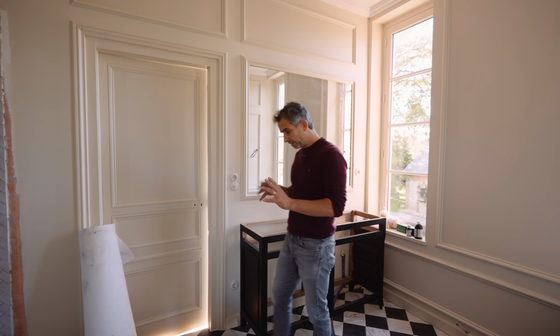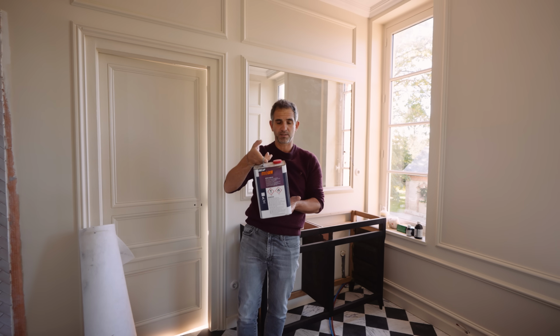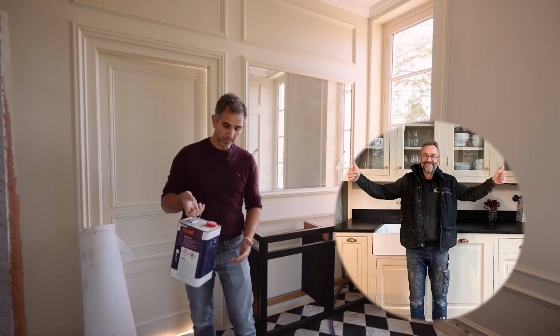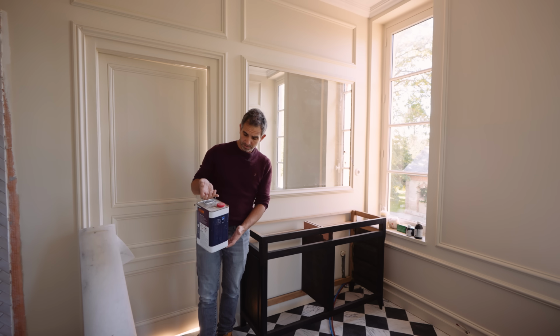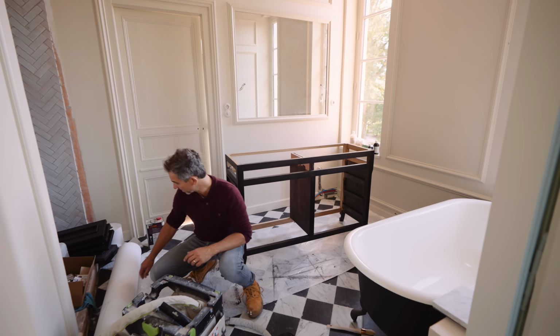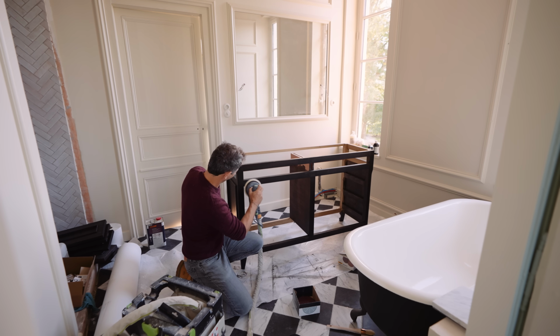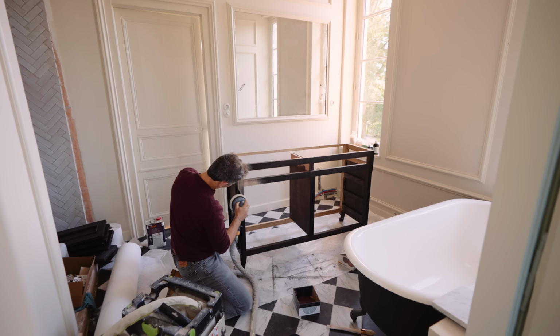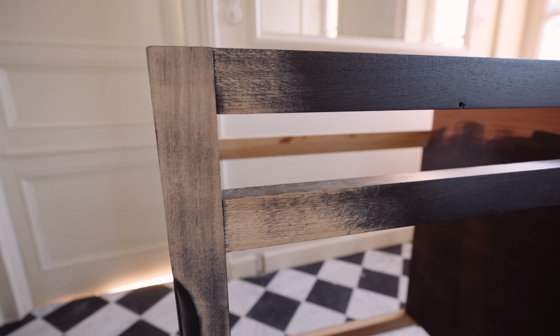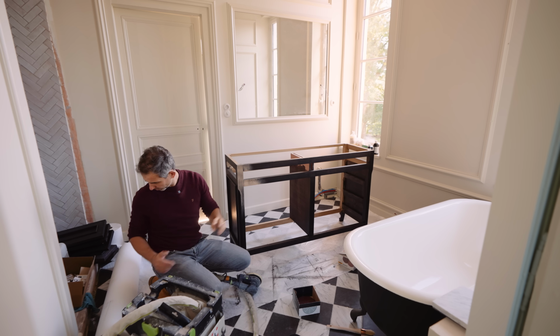There's two ways to deal with this now, and I have two weapons: a sander, and paint remover, Decap 600. Benoit, our carpenter, bought it when he saw what I did to his furniture. He learned that you can also dissolve bodies with this. So I will start by trying some sandpaper, 40 grit, very powerful. It does work, but it makes it a bit rough, and I need to sand it with a finer grit sandpaper later. Now let's try the chemical procedure and see how that works.